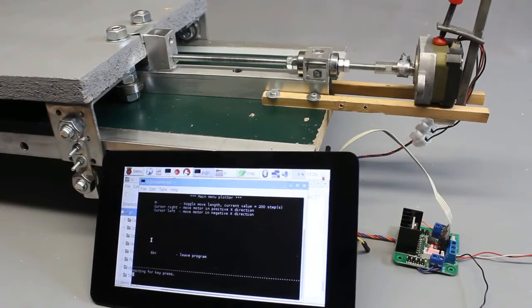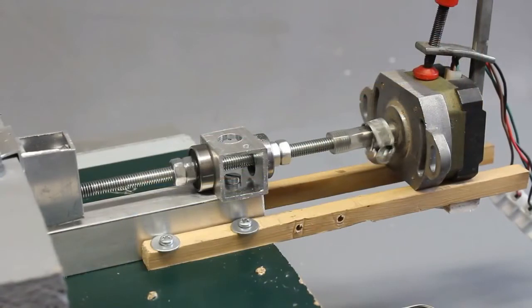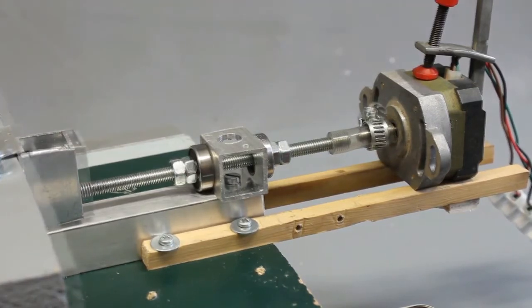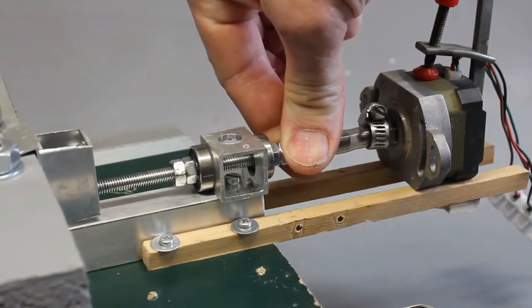When connecting a bipolar stepper motor to the threaded rod, the linear drive works even without sensor feedback. The motor is commanded by a Raspberry Pi. Without feedback, the Raspberry Pi can't detect if the set point is reached. When locking the mechanism by hand, the linear drive doesn't reach the designated point.